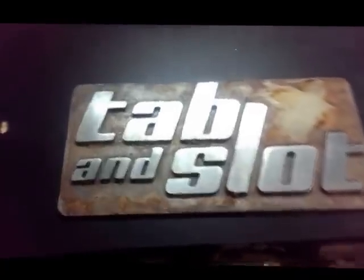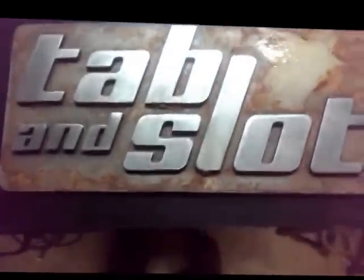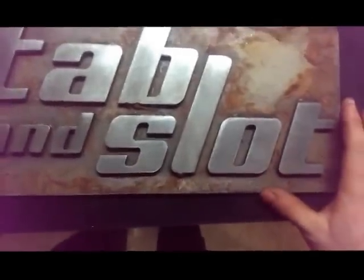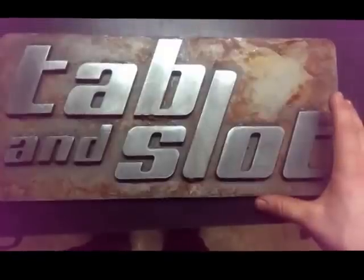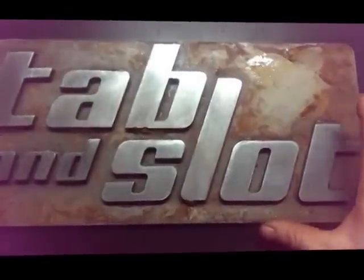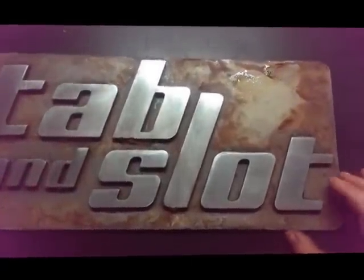At about an hour in, I'm fairly satisfied with the patina — with the exception of one area. I went ahead and used some steel wool to clean up the letters, and then I took a pad sander with 100 grit sandpaper to clean those up. For our final step — well, second to final in my process, some of you may be fine leaving it as is — I'm going to bathe this in water and baking soda, which is a base, and that's hopefully going to neutralize our vinegar and stop the oxidation where it is now. I don't want it to continue rusting, and since this steel has now absorbed a decent amount of that vinegar it's going to happen much faster than it normally would.